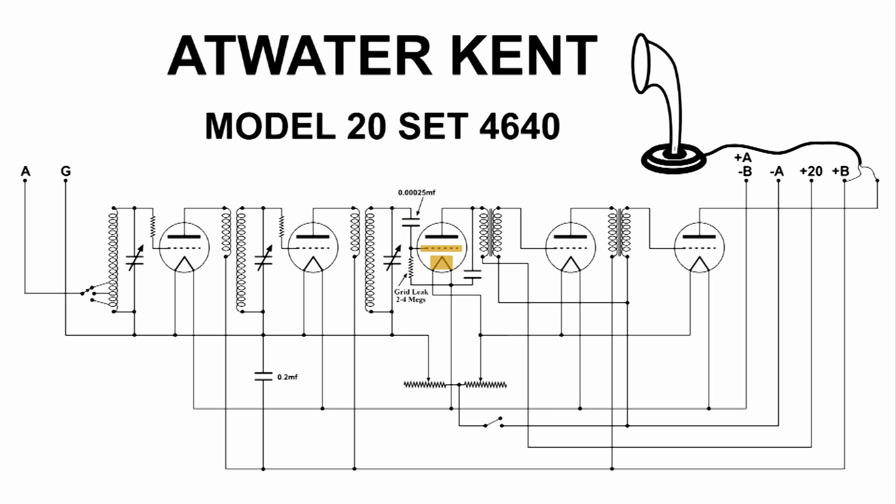In this circuit, the grid and the filament is acting like a diode — the grid is acting like a plate. So not only is it amplifying the RF, but it is rectifying it, which detects the audio. And it's also amplifying this audio. It's this audio that is now going through the transformer and being transferred to the next stage for amplification.